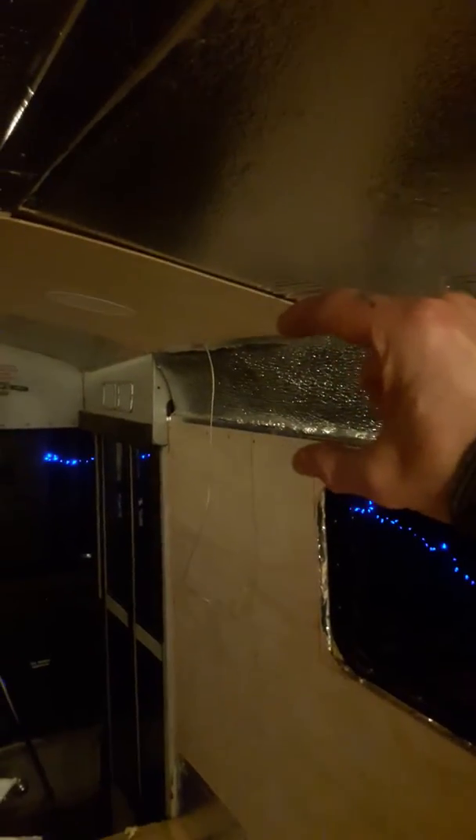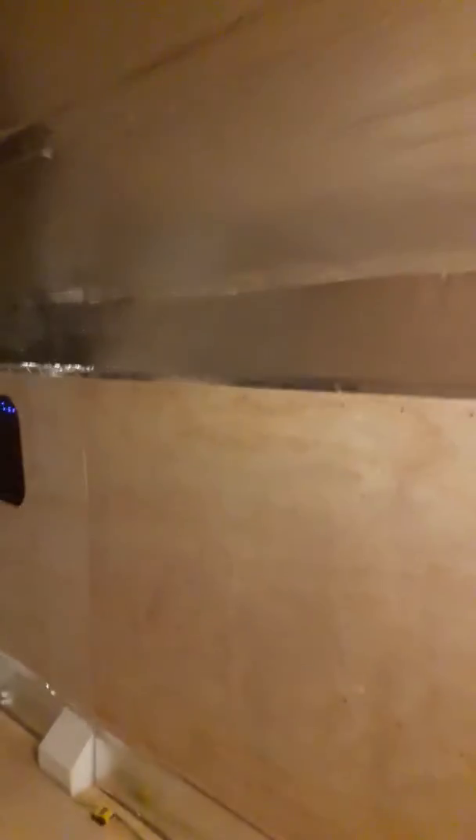But those are the first two lights going in. Like I was talking earlier, this is my panel here — obviously wiring for the light hanging down. It's going to come into the conduit here and run behind this. We're going to have a trim panel that covers from there to there. I'm going to use that to hide my conduit and mount some speakers down the length. It's also going to be the back of the cabinets in the kitchen, so you won't see that there. Then closets and then into the bedroom — so it's going to hide all of our wiring. We're going to have quad boxes dropped over here and there. So stay tuned.